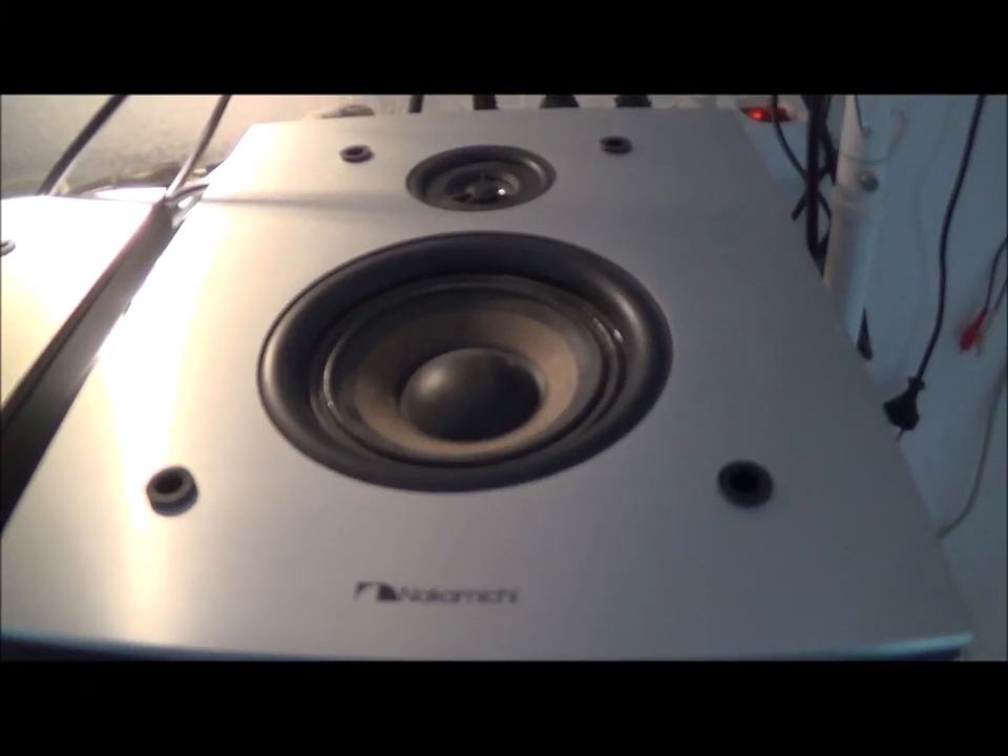Today I'm going to take a look at a loudspeaker. Yesterday I tried to hook up my test loudspeakers and noticed one of them didn't work, so I thought the receiver I'm working on must have a bad channel. I decided to simply swap the speaker wires — I took the right loudspeaker and hooked it up to the left side of the receiver, and the other speaker the other way around, and I noticed it was still the speaker.